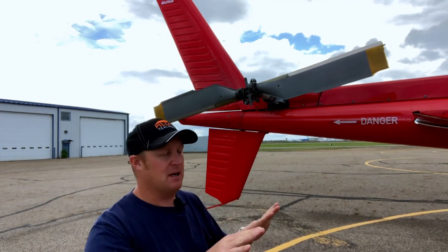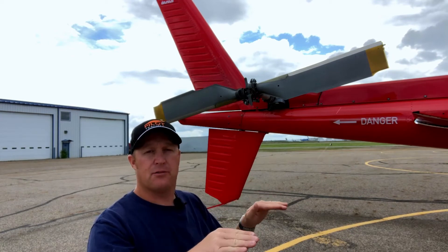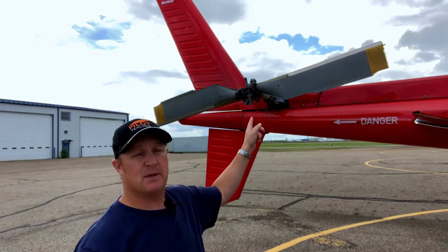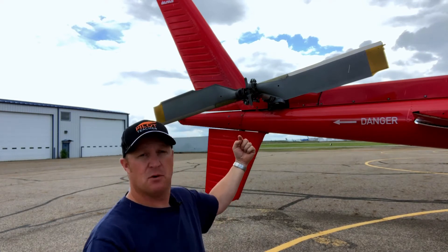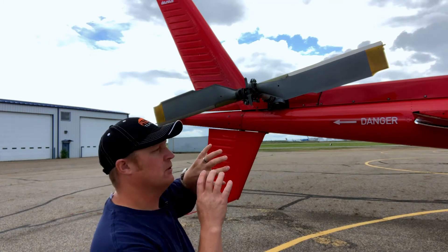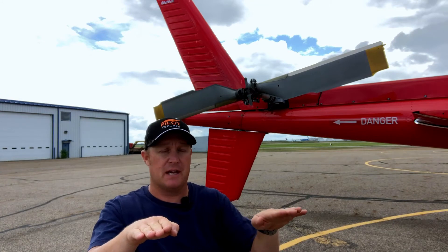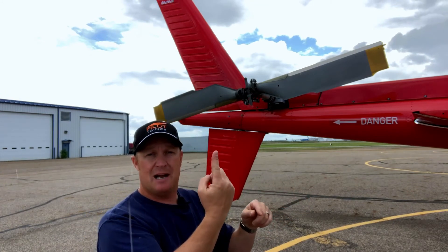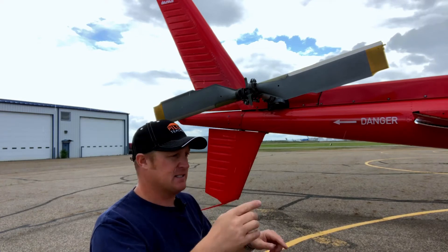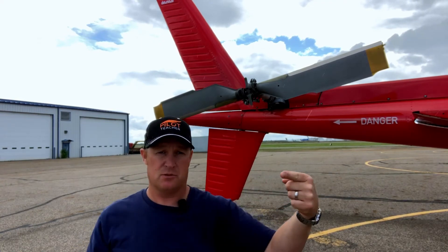When I push the right pedal I need to create more thrust because I'm going against the torque. So it increases the pitch of the tail rotor blades, creates more thrust pushing this way, which then forces the tail boom to the left and turns the nose of the aircraft to the right — because when you yaw the helicopter it rotates around the central main rotor mast. That's the pivot point: tail boom goes left, nose comes right.